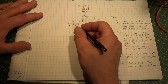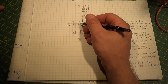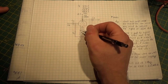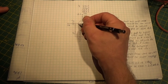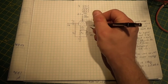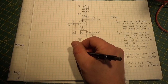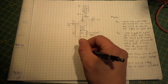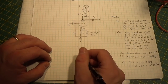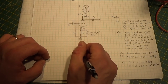Now, the design of these tubes can vary the amount of gain that this circuit will produce with these resistors. I didn't want to get into a whole ton of complicated theory, but basically what we're doing - this is a Class A amplifier - which means we're floating the cathode above ground. We're making the grid more negative with respect to the cathode. By floating the cathode above ground, we bring the grid to a negative voltage with respect to the cathode. So what's going to happen is we're going to set this thing somewhere near the middle of its operating point.